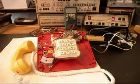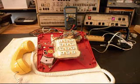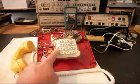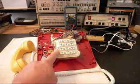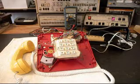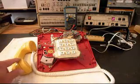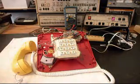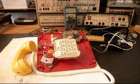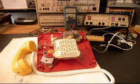Okay, we're back now, and we are finished up in the repair of this Mickey Mouse telephone. And so basically we're going to run through a little bit about what went on. We had to go into the keypad and repair the keypad. And so that included some of the linkage and springs and leaf contacts and things like that. We also repaired the receive for the handset, and we installed a bridge rectifier for proper polarity at the network. So no matter where Jennifer or her daughter plugs this telephone in, it'll always work properly.